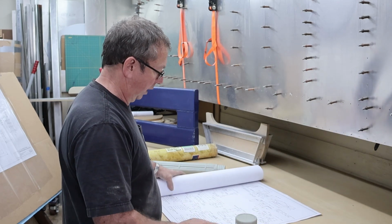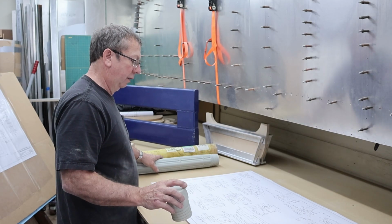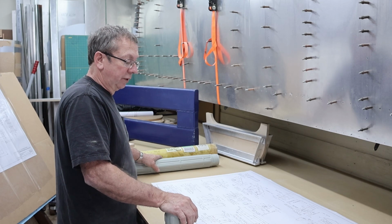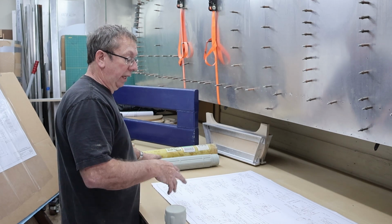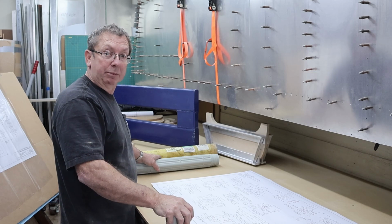And mainly because I've got some 4130 steel coming today for the fuselage fittings to mount the wings. So they're the fittings that have to be cut out, drilled, undersized, then sent out and be heat treated. So anyway, I'm going to get those cut out here in the next couple of days probably. Anyway, I thought I'd give you a quick update.